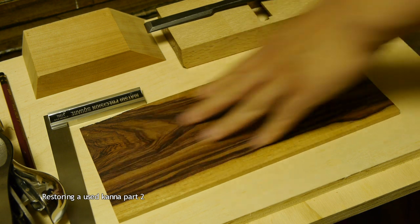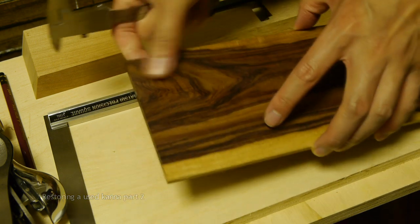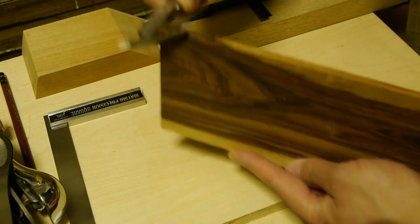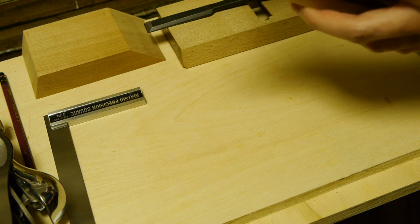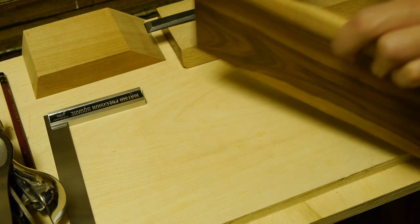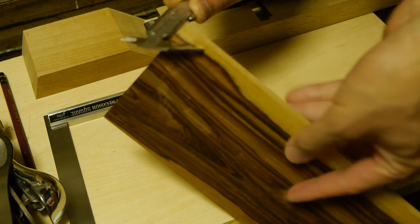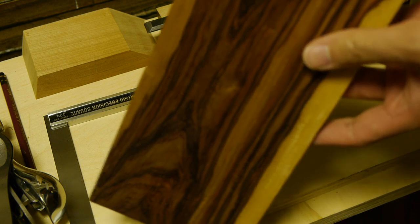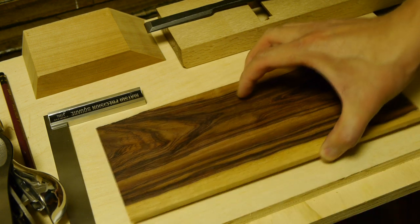This is the bottom plank lamination, checking that it's all even thickness. I've got vernier calipers and I've calipered all four corners - it reads 6.55 millimetres on all four corners. So 6.5, plus or minus 0.1 millimetres all four corners. That should be just fine.